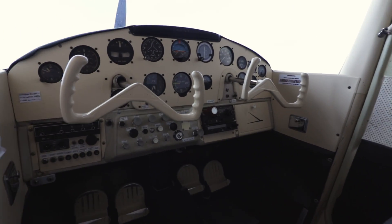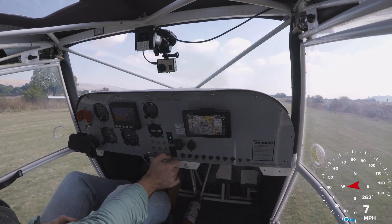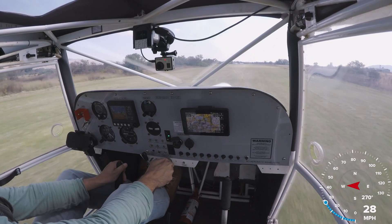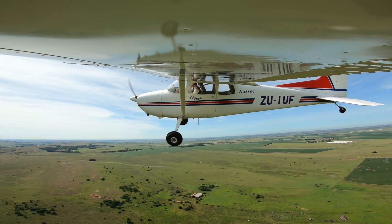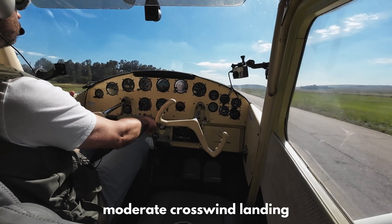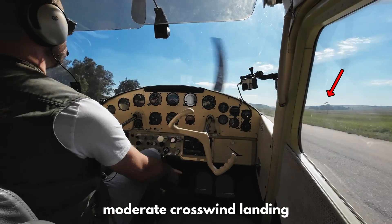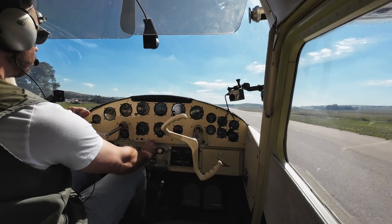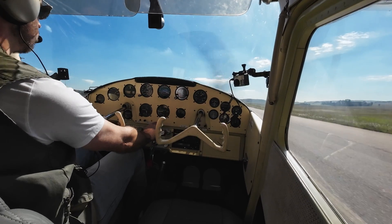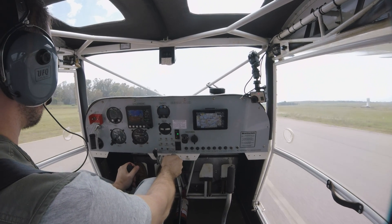Talking about the yoke — I've never been a fan and I'm still not, probably because I learned to fly with a stick. But a yoke does make cabin entry and exit much easier, especially for passengers. As for being tail draggers, I would say both planes fall in the easy tail dragger category, though this is very subjective for a pilot new to tail draggers. The 172 is one of the easiest airplanes to fly, but I find the tail dragger version noticeably more difficult than the Bushbaby. With its tail wheel on the ground on takeoff or landing, it's a bit snatchy and easy to over-control the rudders — it tends to sway from one side of the runway to the other with the slightest excessive rudder input. The Bushbaby is quite immune to over-controlling the rudders and seems to just absorb any slightly excessive input.